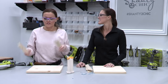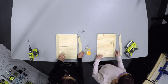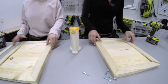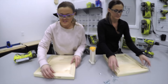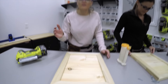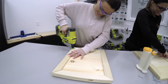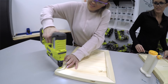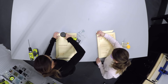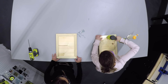Cuts are made. Now we're going to trim this out — we'll lay all of these craft boards on our corners. We like to dry fit everything first to make sure our cuts are where they're supposed to be. Then we're going to attach everything with wood glue and three-quarter inch pin nails. You can use a brad nailer if you want, but pin nails are great because we won't have to cover up holes later. If you don't have a pin nailer you can use hammer and nails.